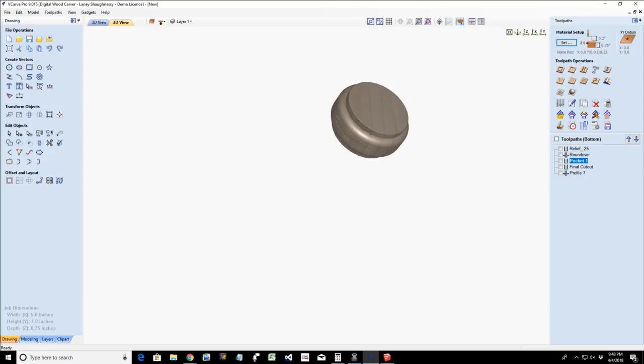What kind of speed and feed for this bit, Wayne? For the V bit or for the roundover? The roundover, I'm running around 60 and 15. For the V bit, I would probably, because when you do the V bit cut, you're gonna do a clearance pass with a straight end mill to cut out the center inner diameter, and then you're gonna run a V-bit inside profile cut with that V-bit